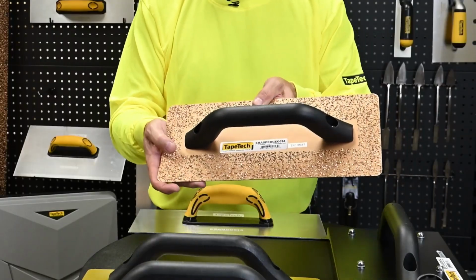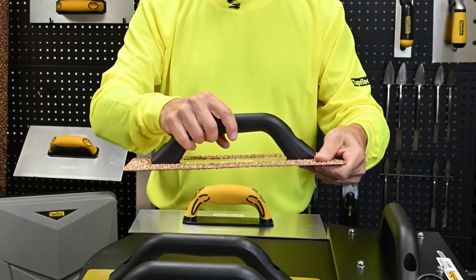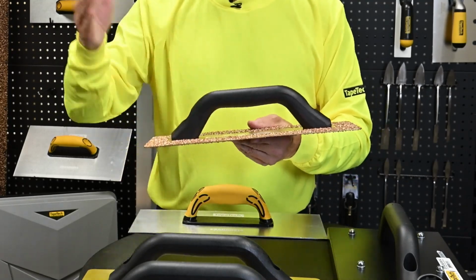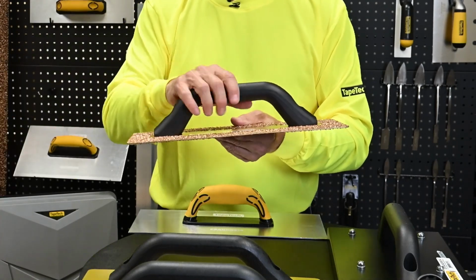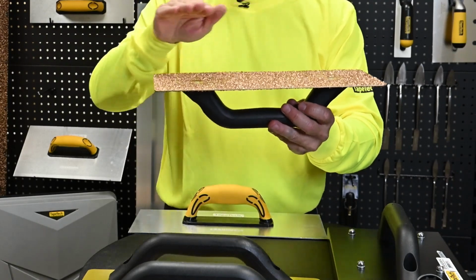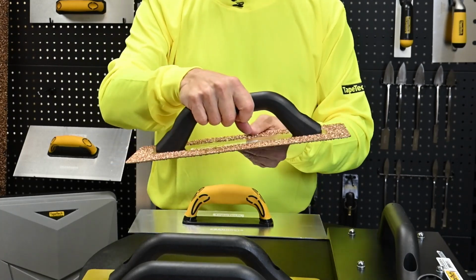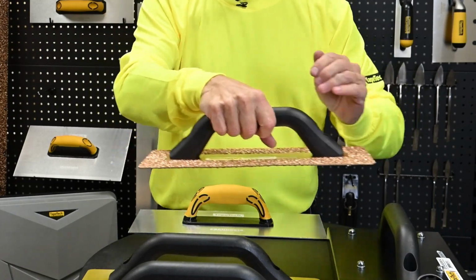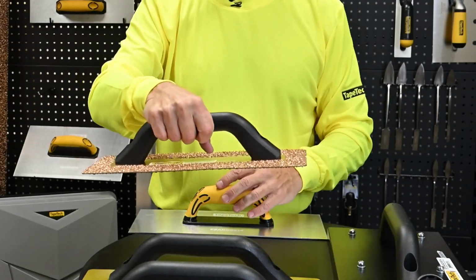We call this the edging rasp. You can see that the tungsten carbide actually is on the bottom but wraps around to the top. And what this is great for is when you've got those foam panels going down to grade and you don't want to lie down in the dirt, or you don't have room to flip this rasp over and prevent that sawtooth appearance at the bottom of your foam panels, you can simply turn it over this way and hit the bottom edge of your foam panels with the top of the rasp and get that bottom edge nice and clean.